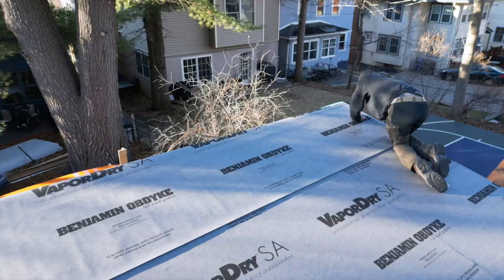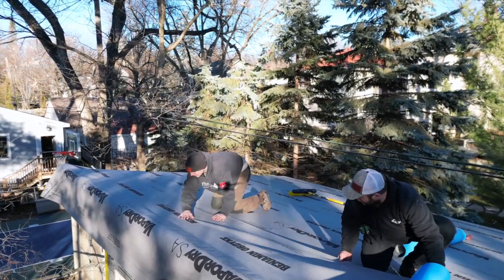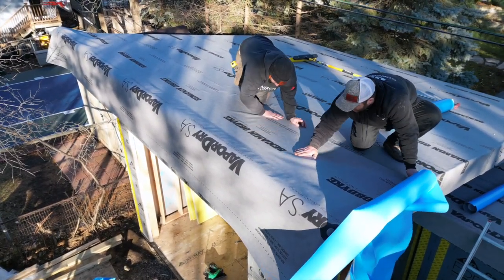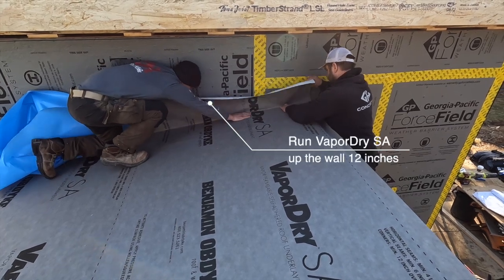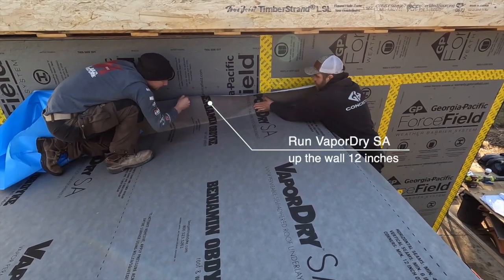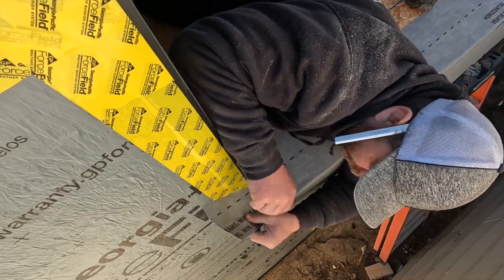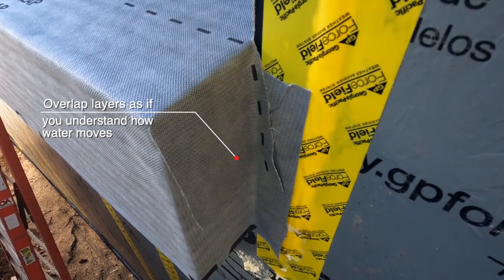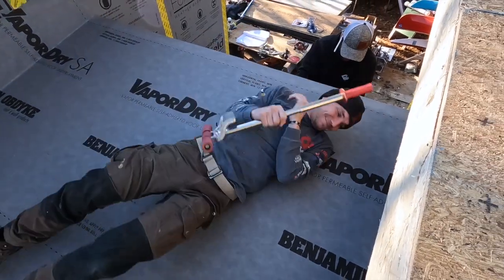The top course is overlapped at the bottom and folded over the fascia at the top. The continuous acrylic backing adhesive allows the sheet to be repositioned easily. Eliminating wrinkles is important because a continuous and flat connection between the membrane and the roof sheathing creates a superior air barrier. At the roof-to-wall intersections, the Vapor-Dry can be run up the wall to protect that vulnerable spot and maintain a continuous air barrier. At the bottom corner where the membrane folds over the fascia, Joseph folds the side flap into the corner and then folds the top flap over that — a smart overlapping technique. When the membrane is positioned where you want it, use some sort of tool to apply pressure and activate the adhesive into the substrate. This is often done by rolling it.